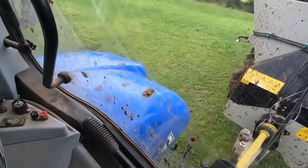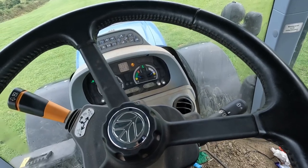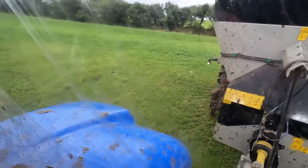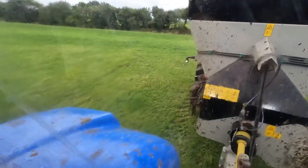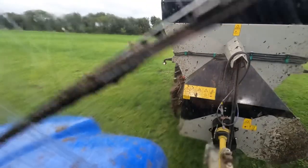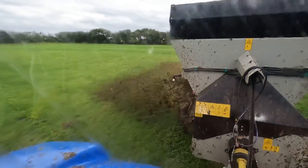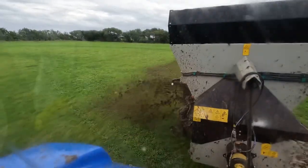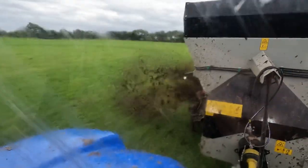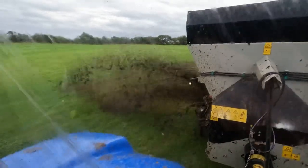PTO on, and then we'll put the revs up to 540. There we are — now we're going to start moving forward, and then turn it down again and then again, ever so slightly, release it. Since it's slower it will come up faster, so I'm going to drive it a little bit faster and open it a tiny bit more. As you can see, that is a nice spread.